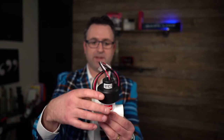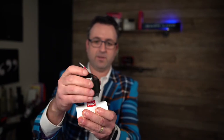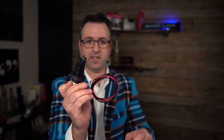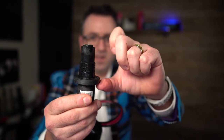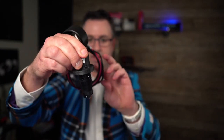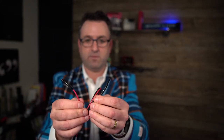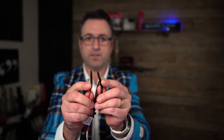Let me open this up so you can see exactly what's inside. Essentially there is an impeller — I'll just slide this out. There is an impeller that spins. See how that spins? That's all it's doing. Water flows past and as this paddle wheel impeller spins, it puts out a pulse. We have our two wires here — the red and the black — and basically there's a pulse coming out, almost like contacts touching: pulse, pulse, pulse.